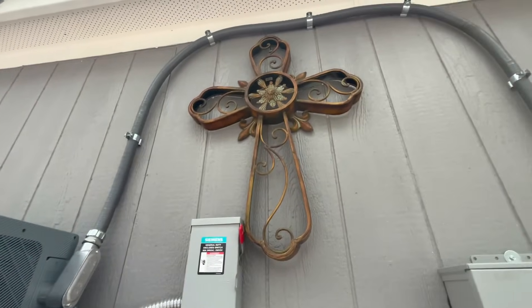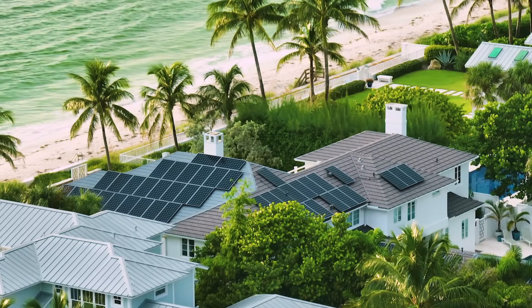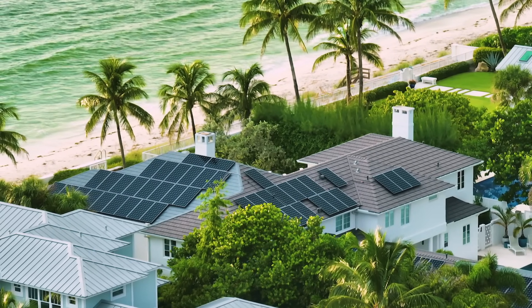You can do all this with the grid still connected as backup power if your batteries get below 20%. That's how we use this unit. And if you already have a solar system installed by another company where you sell back to the grid but don't have battery storage, you can install this and connect those existing solar panels via AC coupling or DC coupling, whichever is needed. So for those who already have a system but don't have one that runs when the grid goes down, this is for you.